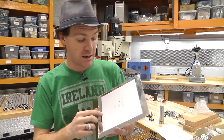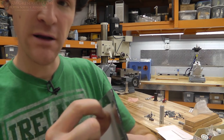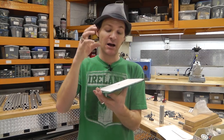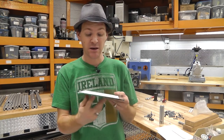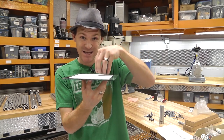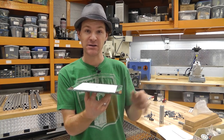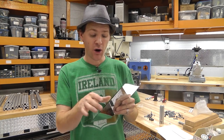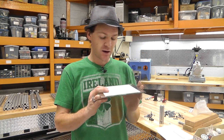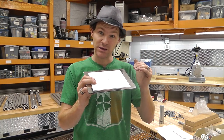I'm going to basically be cutting a piece of this out, because it will peel off. You can peel it back off. It does come off, and I'll be placing it on the center of a solid piece of glass, and I'll be cautious with what I do, because honestly, this will work perfect for small pieces that I want a very small point to stick to. It sticks really, really well, way better than it does to the glass with the ABS juice on it. So all in all, I will still be using this. I'll just be using a smaller piece of it, and I'll watch that I don't do what I did in this video, which was start the layer too close to the top.